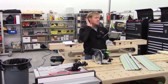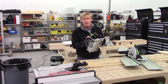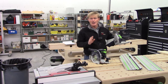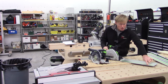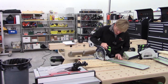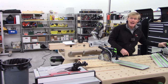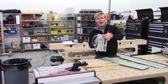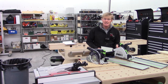I already have a battery-operated track saw from Festool, so why do I need another battery-operated track saw from Festool? These are very different tools. Both of them ride on a track with slots on the bottom on the base. With any of the different lengths of tracks, you drop it on, the track is right on the line where you want it, and you make your cut. The difference is this one also works on FSK tracks, which have an added T-track that rides in the T-track area on this saw. The other saw does not have that and so it cannot work on FSK tracks.